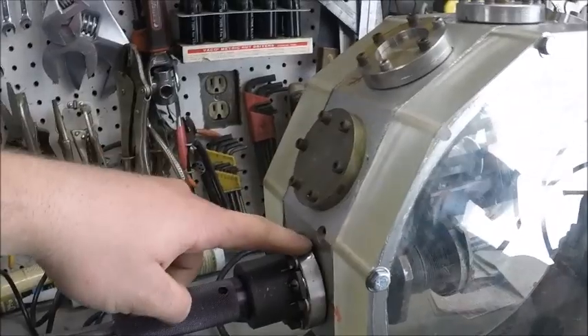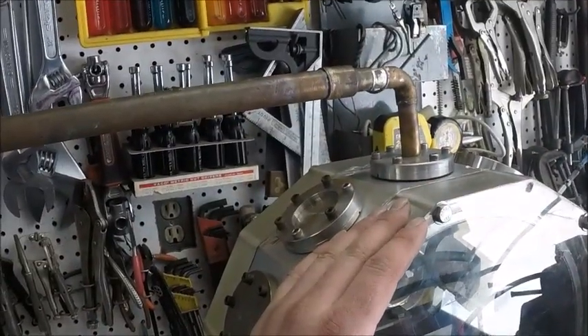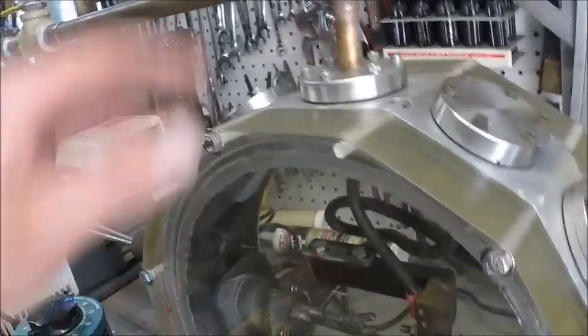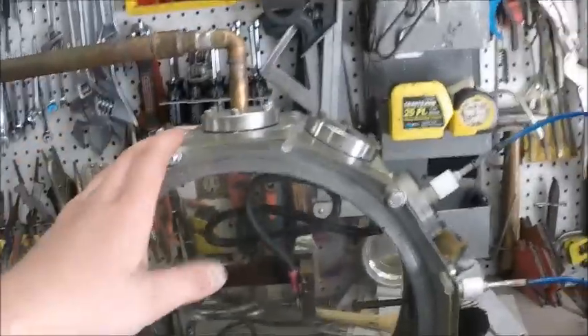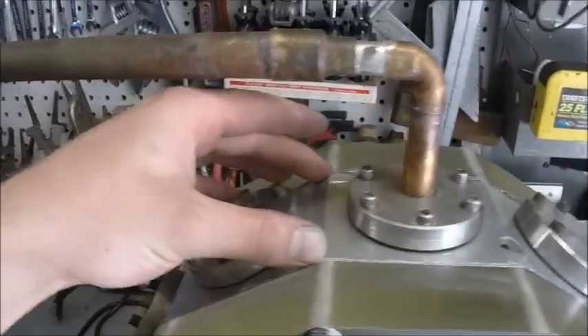The seals are all maintained here at this joint to that joint. I made these equivalently-shaped pieces of acrylic — they're one and a half inches thick, made from plexiglass. I had a bunch of really old stuff that I dumpstered a long time back; it was in good shape, not UV degraded. I drilled 12 holes but only ended up using 6, because 12 holes per side is a lot to drill and tap. They're 1/4-20 bolts, 1/4-20 tap threads in the aluminum block. You can see the hole there — I ended up drilling all the way through, but really didn't need to; this is roughly 3 inches of aluminum here.